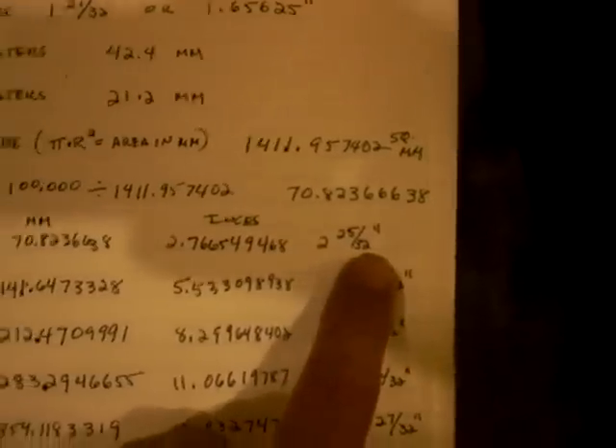If your tube is a different diameter than this, you can't use the data I collected here — you'll have to do your own math. Everything measures off of zero and is cross-checked with the inch dimensions. The distance between each 100-milliliter mark works out to 2 and 25/32 inches. After calculating zero to 100, zero to 200, all the way to zero to 700 and beyond, I doubled back to confirm that spacing of 2 and 25/32 inches held consistently between each consecutive mark — basically confirming that I did my math correctly, since all marks are equally spaced.